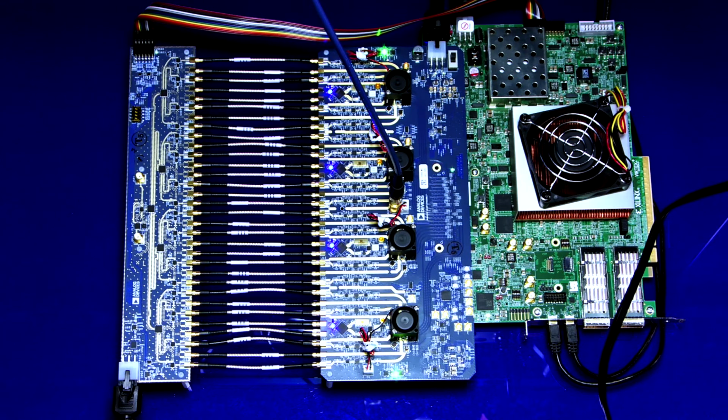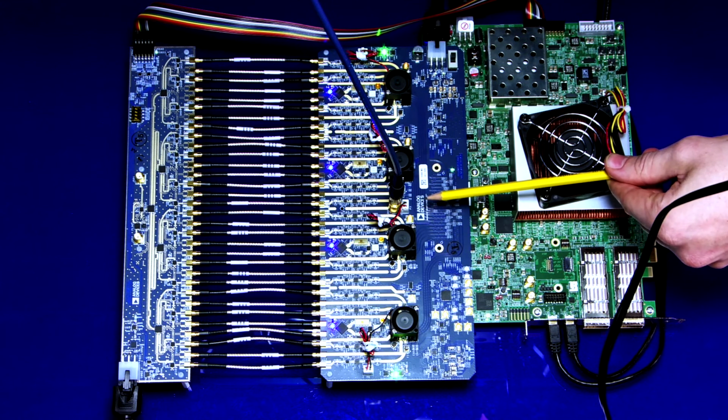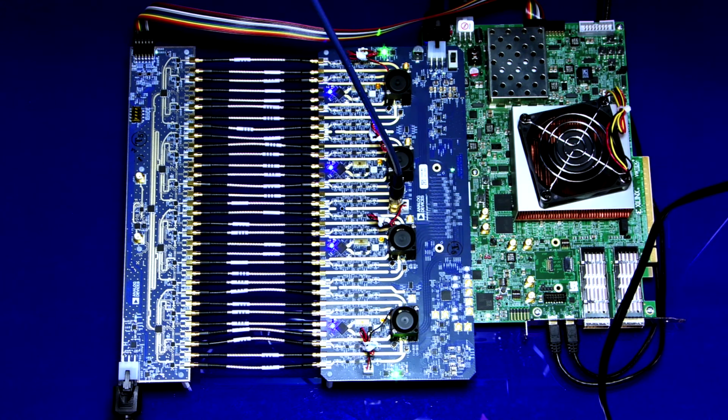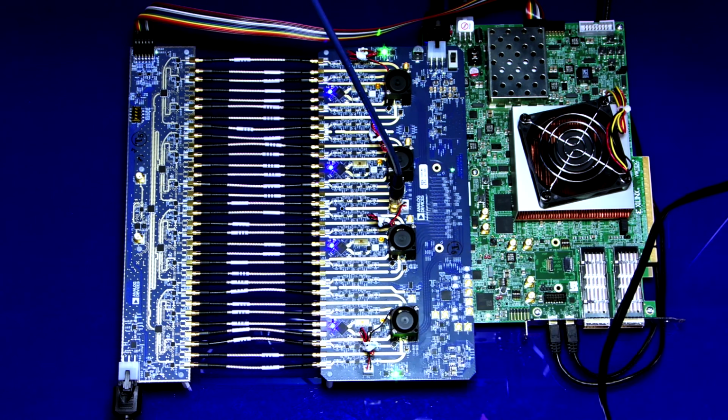At this time, we will apply a 500 MHz 0 dBm clock signal into our Quad MxFE board. We also connect a calibration board to enable combined TX to RX loopback. For more information on the calibration board, please see the calibration board unboxing video or the wiki. The FPGA is then programmed to boot Linux and configure the Quad MxFE in one of several use cases.